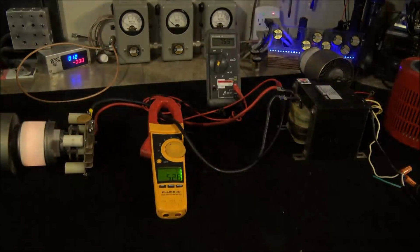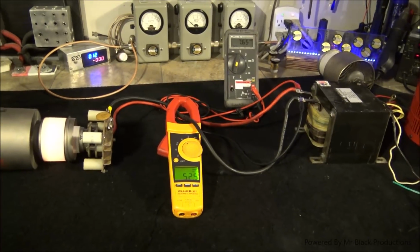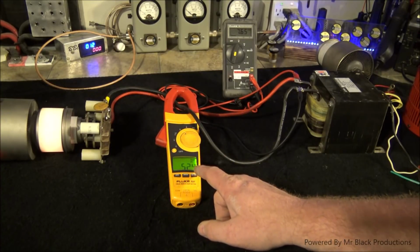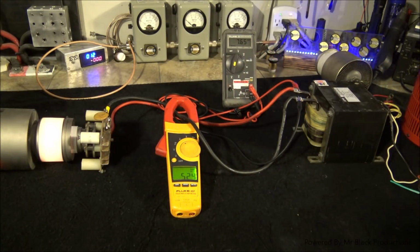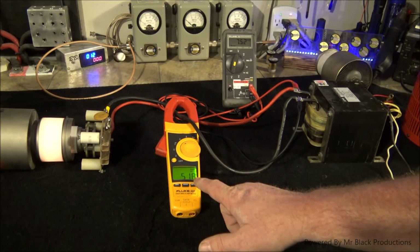And this gives us a little sneak peek behind the window, right? And what we're going to do is let it heat up. We're at 52.4. That's pulling an amp high on filament. And see, now look, our voltage has started to rise as the tube heats up. So bring that back down. Close enough. 51.18, 7.5.